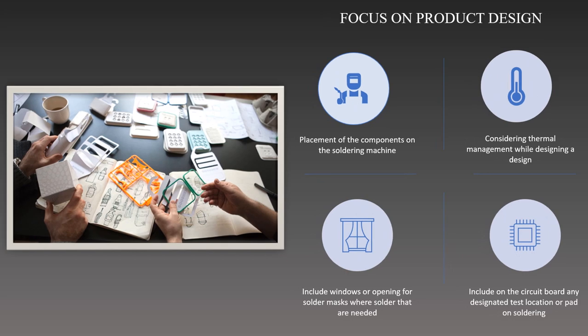The effectiveness and productivity of the soldering process can be significantly improved by designing items that can be used to solder. We can organize the circuit board's components so that soldering can be done with ease, avoiding crowding that might disrupt the soldering operation, and leaving some space between solder points for the iron tip to reach with ease. Next, in order to avoid thermal damage, we need to manage heat when designing a product. We can make sure that heat-sensitive components have enough space and have heat dissipation routes around them, and design heat sinks to achieve the best heat distribution.